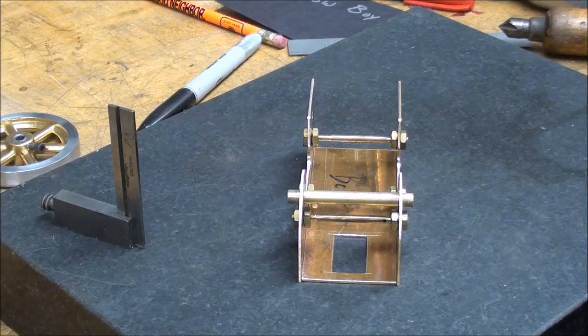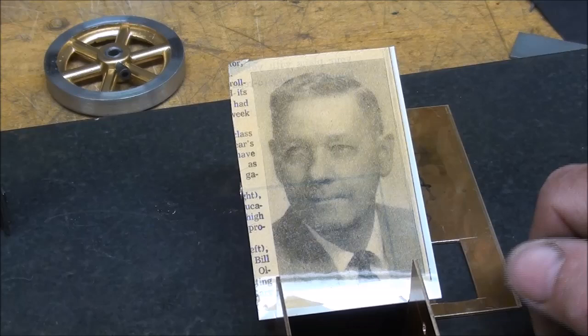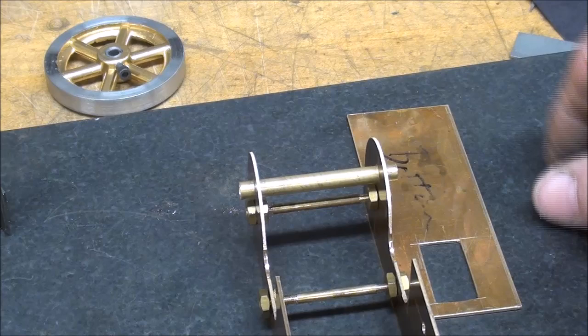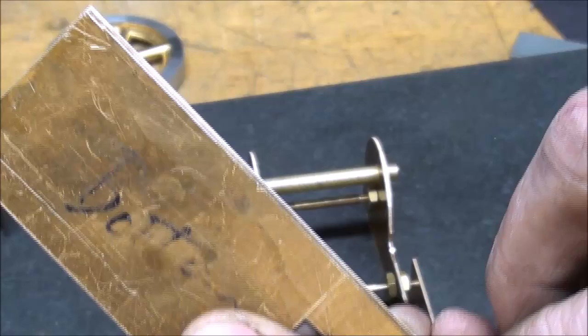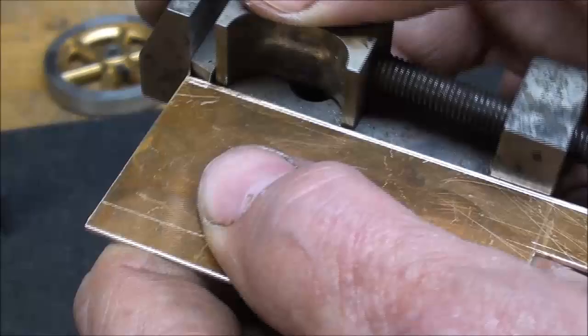There's my dad, who was my teacher and mentor — I mentioned that before — and he died when I was in college. Lucky Strikes murdered him, and I'm still mildly bitter about that. A wonderful man — never any abuse or cruelty going on in our house. What I've done now in preparing for solder — notice how I cleaned an edge here. I did that with my little vise; I've got a lathe tool in there and set it almost like you would set a marking gauge, so it allowed me to shave it like that.